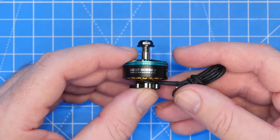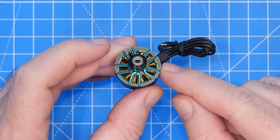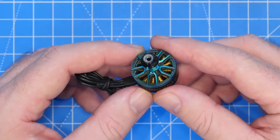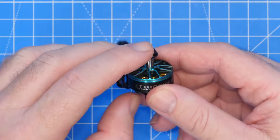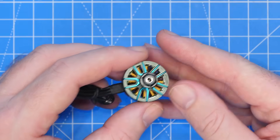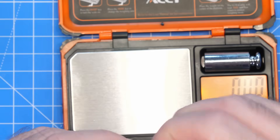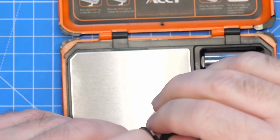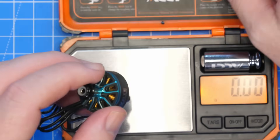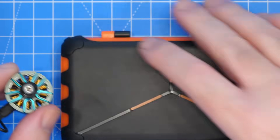Moving over to the ZTI - this is the 2085kV version but still 2207. You can see this doesn't have a Unibel design, it's a two part. You've got your top section and then your bottom section, and then your magnets placed in underneath. Basically the same overall setup as we saw on the VTI - you've still got your hollow shaft and that silver plated enamel copper wire. Weight wise they say it comes in a little bit less than the VTI at 32.8 grams. On the scales I'm coming in at 33.2 - there may be a little bit of variance, I wonder if the spec is without the nut. Overall very close to specification.